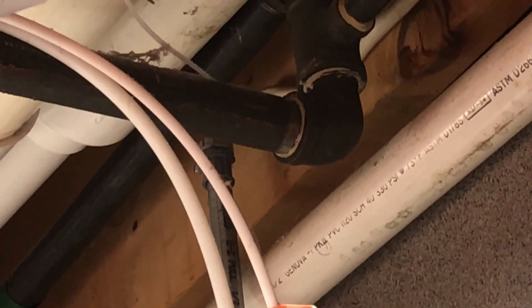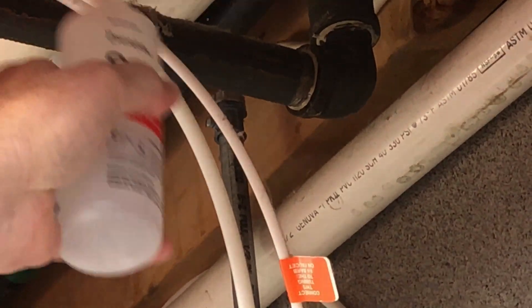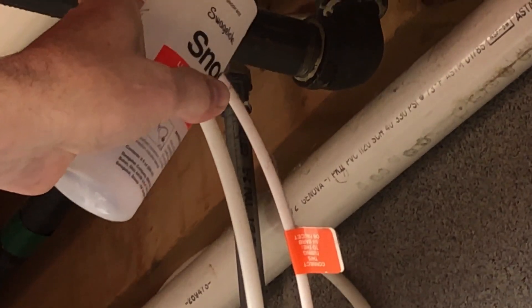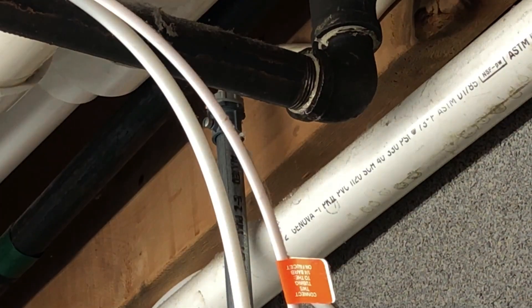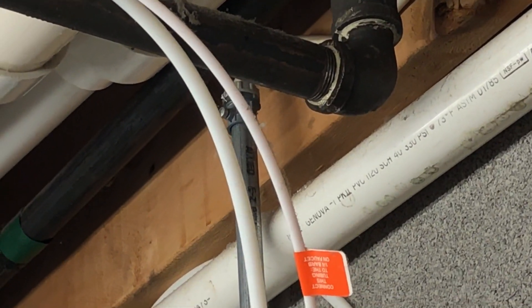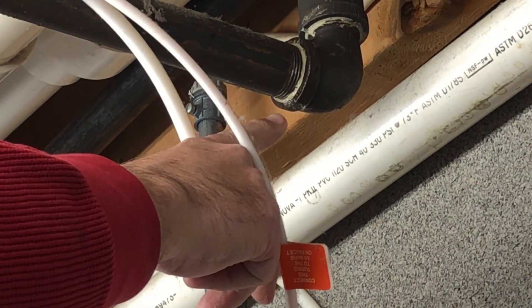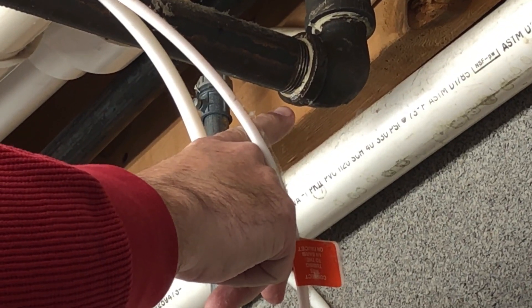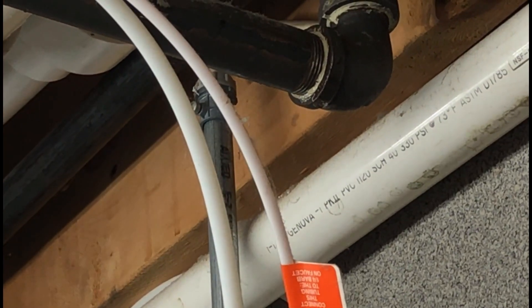We've got quite a bit of different piping up here, and I'm just going to go ahead and squirt a little bit of the Snoop on the fitting here, and we'll test the one above it also. What we're looking for is just bubbling, because the gas leak detector shows you the general area of the leak. And you can see right here this is starting to what's called 'cocoon' — some small bubbles starting to come out of there. Go ahead and zoom in on that if you can, and you can see those bubbles starting to come out.